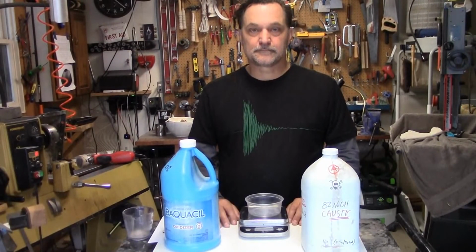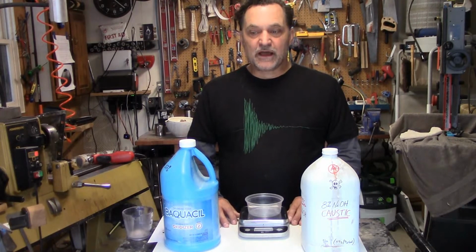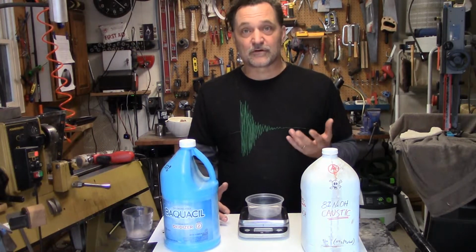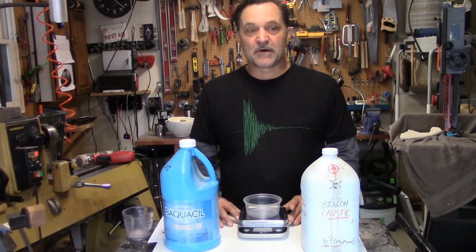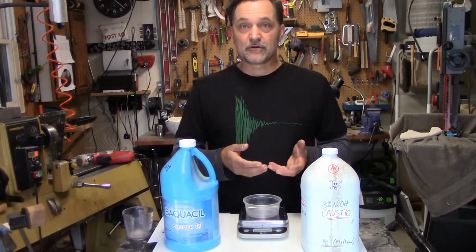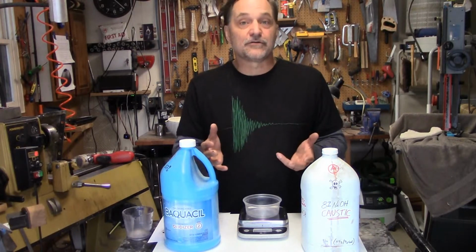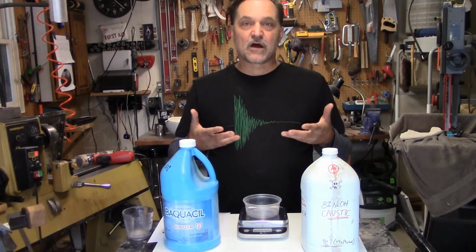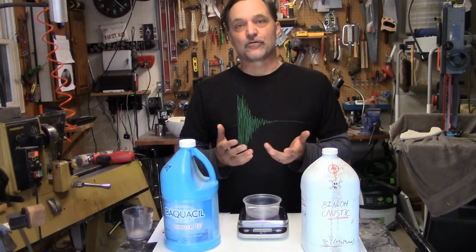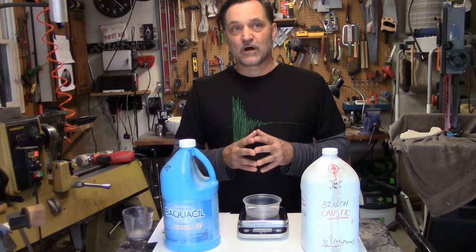So Bill, when you first add the bleach, does that raise the grain, and what do you do about it? Well, what I like to do when I'm sanding, usually on most of my pieces, especially if I'm going to have sort of a water finish, is raise the grain with either denatured alcohol or water after I've done my final grit sanding, to 400, say, and let it dry. That normally pops the grain up, and then I will lightly sand it back with about 600 grit, and I'll do that twice, and I find that it helps the next time it gets wet.